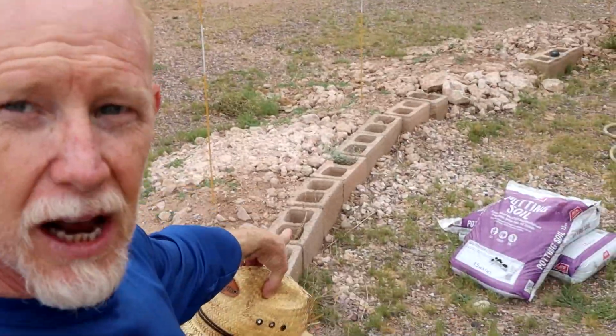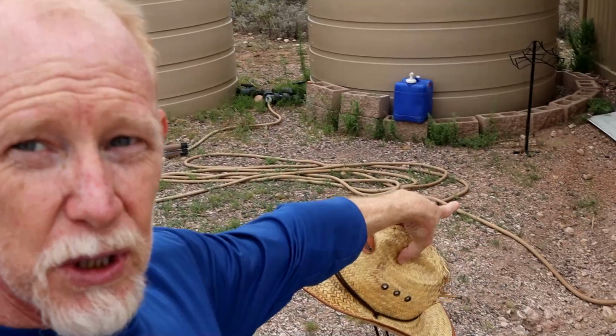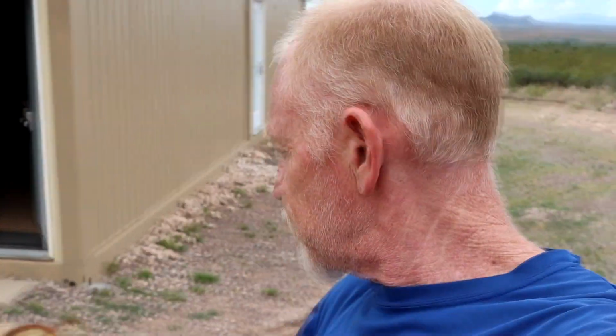So I put in this berm of cinder block and dirt, and then for anything that falls in this general area in here, it tends to go towards the house. So I've got a trench started that goes right here. And it's kind of dangerous the way I have this little piece of wood on top of it to walk across it, because in this spot it's about a foot across the trench and almost a foot deep. And then it drains out that way down towards open land. So the first thing I want to do is get a bunch of my large gravel that I have left over from doing my last gravel project and fill in this trench. And because it's big gravel, it'll basically still be a French drain without a pipe inside. Rainwater should fill it in and still generally move itself downhill. And that way I can get rid of this janky plywood setup.